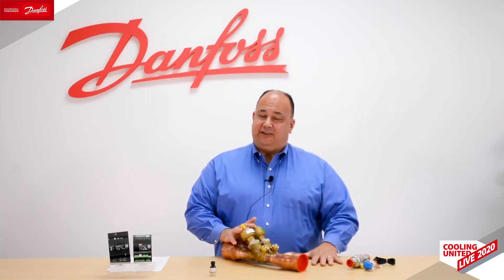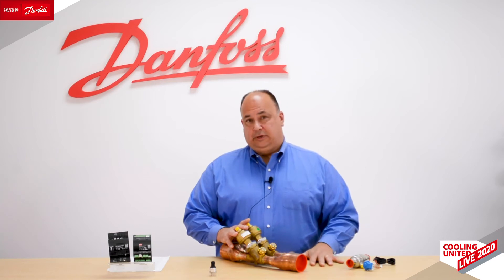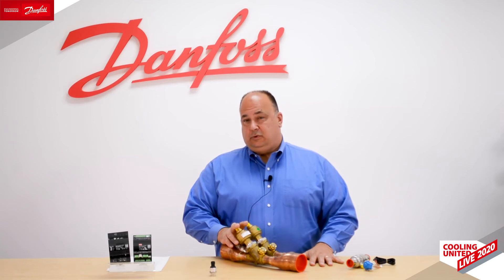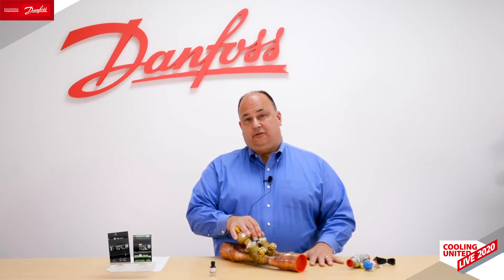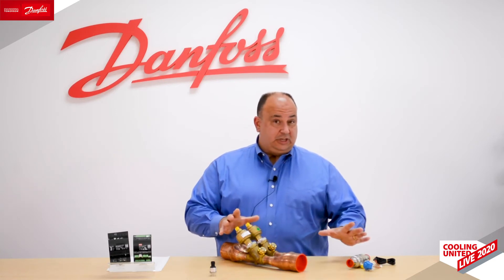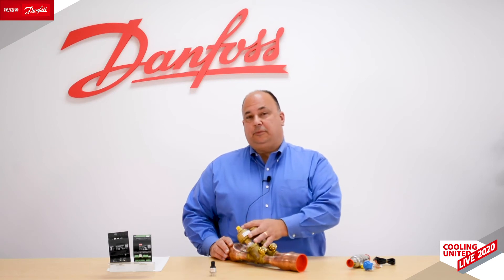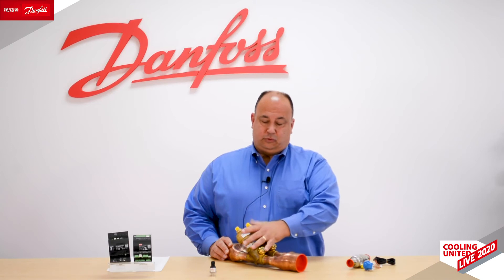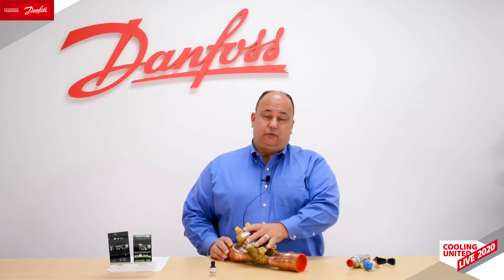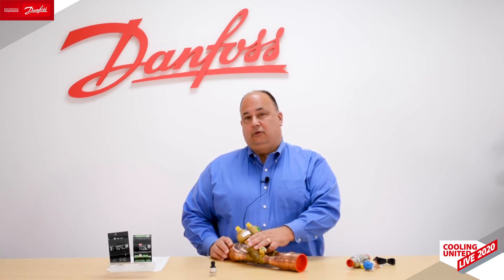Something all three valves have in common is they've been designed, tested, and qualified to work in oil-free environments. If you're designing a system with a Turbo Core compressor — Danfoss's centrifugal oil-free compressor — you want to make sure your components are also tested and qualified that way. Many components today are tested in dry air, but it's very important to test with dry refrigerant in the system for the lifetime of the valve. Refrigerant acts as a detergent and will wipe any grease from manufacturing off all internal components — just because it works in dry air doesn't mean it will work in an oil-free refrigerant system.